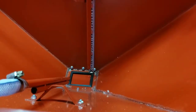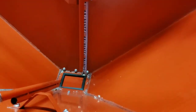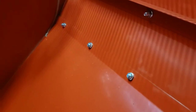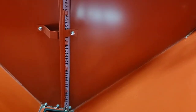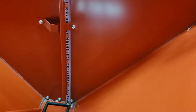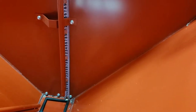I got the tape touching the bottom — this is 53 and a half centimeters deep. There is absolutely no need in the world to have that much media in there, so it's just a waste of space. If you lower this tray — which is basically the table that you work on — down to a sensible level, where that joint is, I'd still have about 35 centimeters worth of depth for media, and that is plenty.